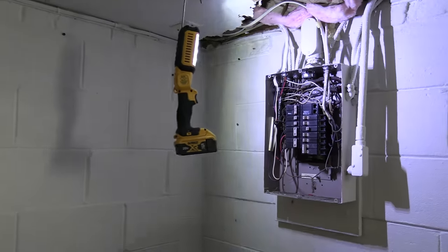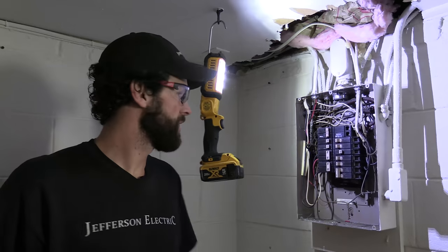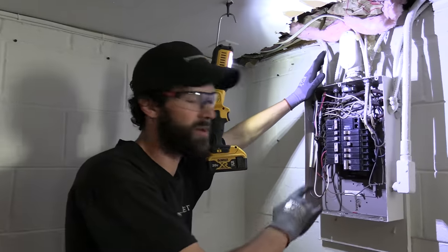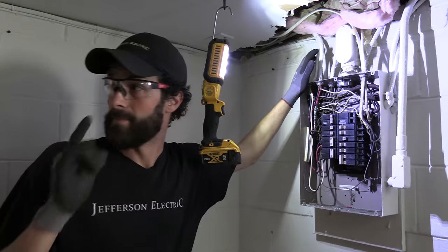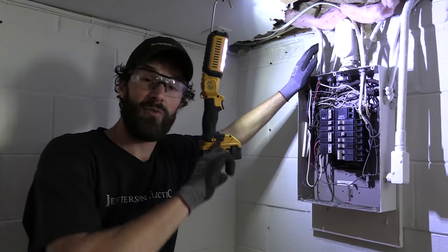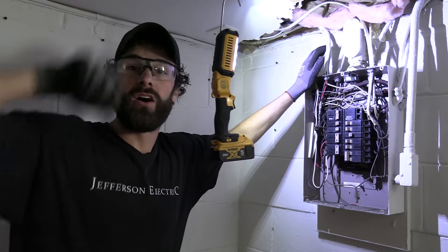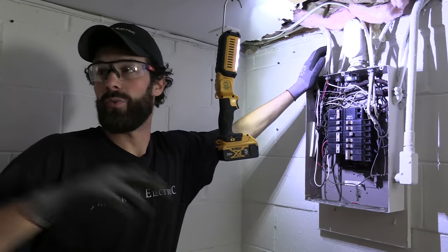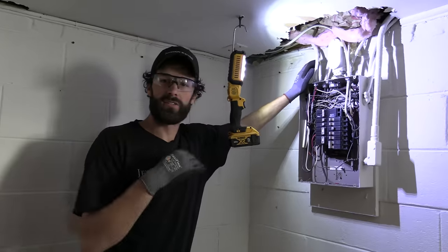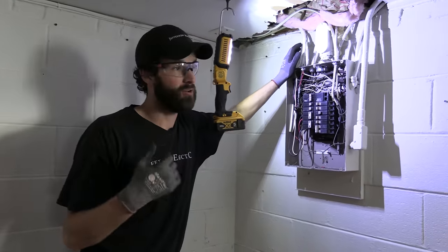And so I've intentionally excluded bonding of gas and water lines in my scope because a 100 amp panel is bonded with number 8 copper, a 200 amp panel is bonded with number 4 copper, and this is getting all mixed up, bathrooms, kitchens. If I run an expensive bond wire that's gonna cost me $2 a foot, only to find out later that the ceiling comes out and all the water lines get replaced when the kitchen and bathroom are plumbed in, no. Excluded from scope of work, and the electrician who's working with the GC at a later date can take care of that, and hopefully that's me.